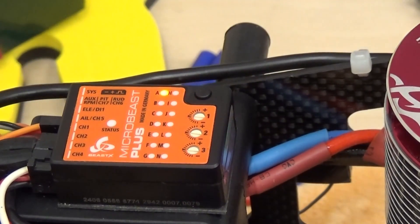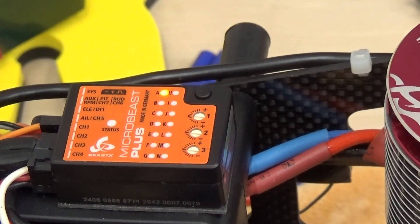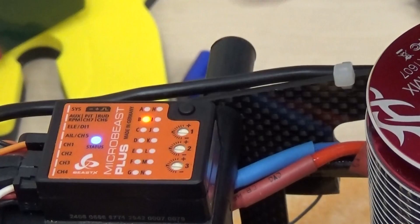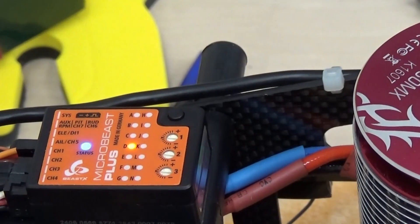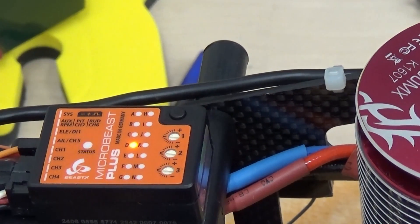Based on the quick reference card, the first thing we have to do — position A on the setup menu — is set device orientation. Light off means horizontal, socket in the front, exactly what I want. Next is swashplate servo update rate. We're setting the swashplate servo update rate at 200 Hz, which is solid blue — still good. Point C is rudder servo center pulse: 1520 microseconds, solid blue — that's right. Point D is rudder servo update rate: 333 Hz is blue flashing — that is correct.